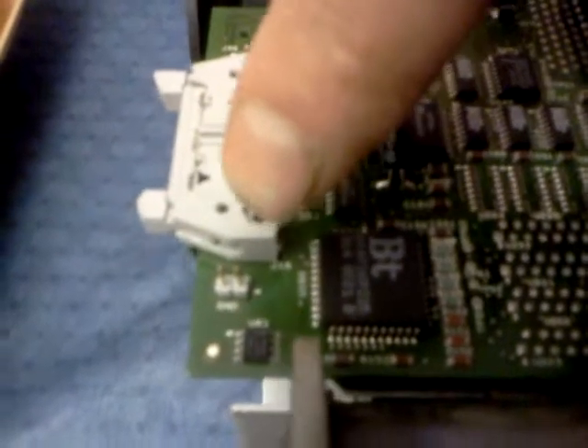So we see here — don't touch J18. I think this is a new connector. I see somebody put some initials right there, and I wonder if that connector is not like this style connector or this style connector, and that connector is actually too wide. Where the J18 pins are, I think you can just see a little reflection of the pin headers where they used to be.